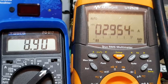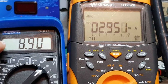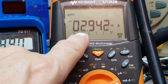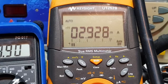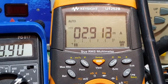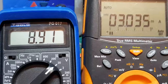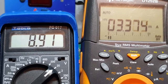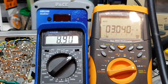See, the higher the current, the more battery drain you've got. So we've now got our voltage correct — 8.9 and 3 milliamps thereabouts. I'll leave it just for a few minutes, just to warm up and just to see if it drifts anywhere. I'll give it a final tweak. It does look like it's dropping slightly, so I'll give it a few minutes and a final tweak. There we are — 3.03. That's pretty stable now. It just jumped out — that's because my phone's interfering with it and giving it a signal.